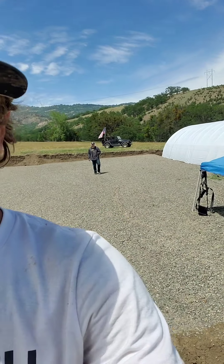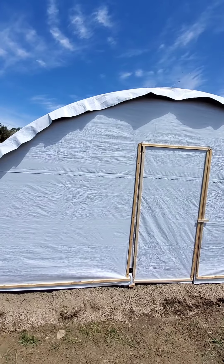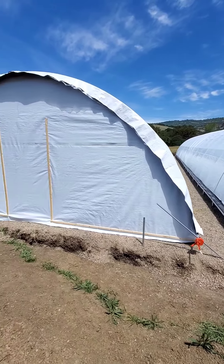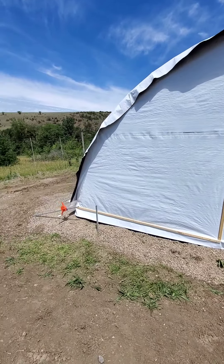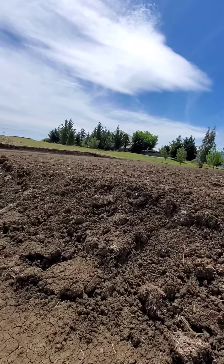Alright everybody — base camp is loaded on top, everything's cleaned out of the greenhouses. We're going to be building seven 10x90s right behind me. This is the final road for the finished product. Haven't framed the door yet — we're going to do that tomorrow. Still have to finish the clear poly sides. I hope everybody enjoyed this video and that you guys get the gist of how to apply clear plastic, how to apply black plastic, what comes with the hand cranks, the motors, the clips, what clips go where, what pipes go where, what a purlin is, what a roll bar is, and which roll bars to use.